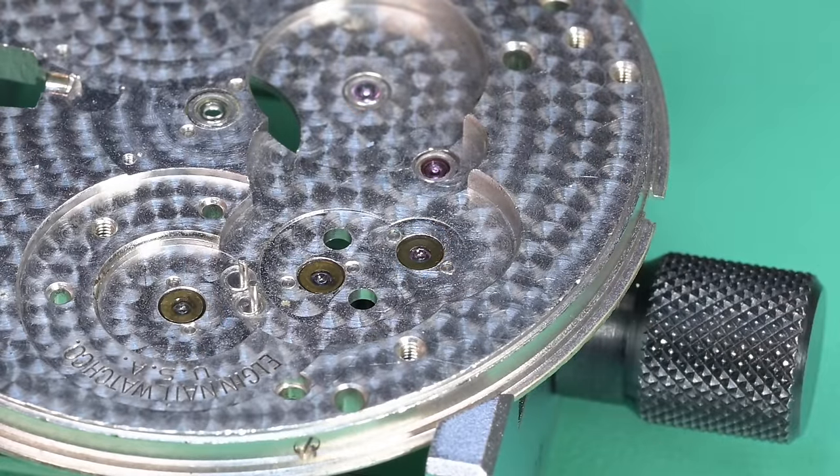Taking a look under the microscope just to make sure the barrel is flush all the way around — that thing is looking great. Now I'm going to apply a bit more lubrication to the bottom arbor port, and then a little bit more oil on the top side as well. All those assemblies are finally put back together — cleaned, jewels done, and everything else. We can actually put this watch together now. We'll start off with the escape wheel and the fourth wheel, making sure that long pivot goes through that jewel.